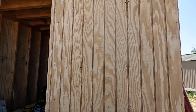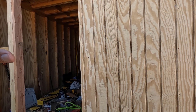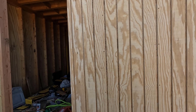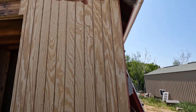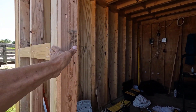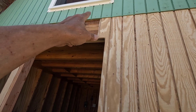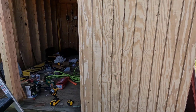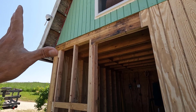We got the first panel in. I will be so glad when we're done with this remodel stuff. This thing is 20 years old and it was just a storage shed to start with, so everything's just a little bit out and I have to kind of fudge everything to fit, but it's going pretty good. This panel looks real good — it's like three quarters at the top and a half inch at the bottom, but all of these new studs are plumb and the door will fit in here just fine. I'm going to go cut that next panel.